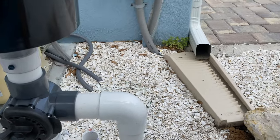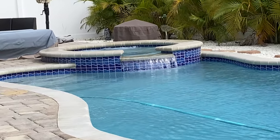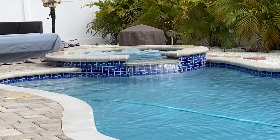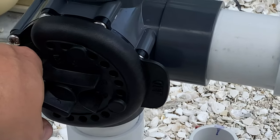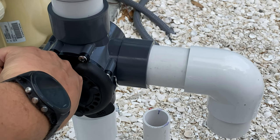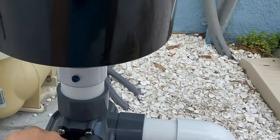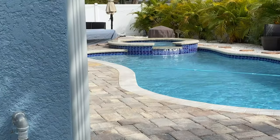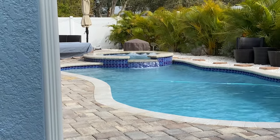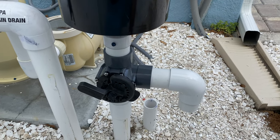This is full power here — see it kick off in a second over there at the spa. There you go, pretty much full blast right now. Now as we open this valve up and let some of the air out — if we go to the extreme and pretty much close that off, it's dead again. So now if I dial it in, we just find our sweet spot. That way you can control the pressure the blower is giving you in the spa. So that is how you get that taken care of. Like and subscribe and stay tuned for more videos — have a great day.